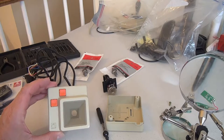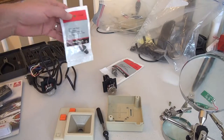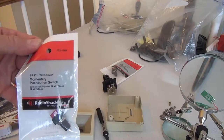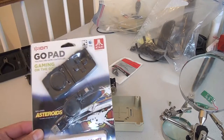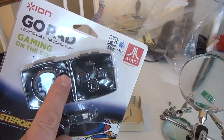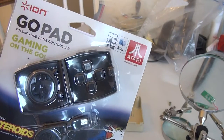We also have a lot of joysticks with old buttons that no longer work. I've gone to Radio Shack and got part number 2751566, a momentary push button switch. I've also got an Ion gamepad — you'll notice that this has an integrated directional pad, and that'll be important, as I'll explain why later on.